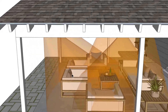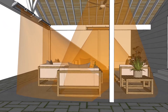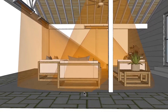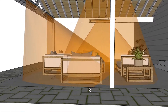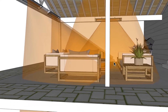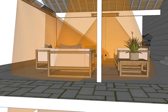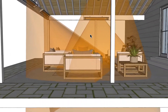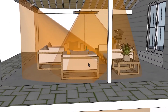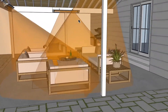Looking at the footprint of heat, you can see it gives fairly decent coverage. These two units are really covering these two chairs and a portion of this chair. This ray comes out about 10 feet from this point — that's the most ideal footprint or penetration of heat. Even though you're out at this distance, the intensity isn't the same as it is at 10 feet out. With just two units here, I'd say it would be okay for this space, but out here — definitely not. You definitely need additional units to cover this outer space.